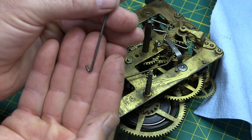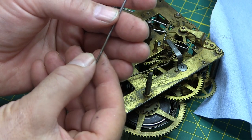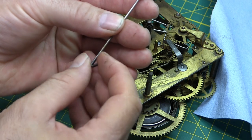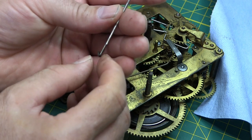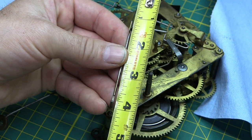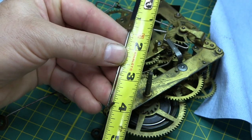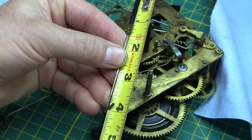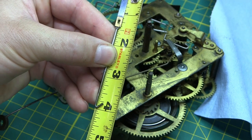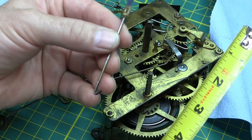It's kind of a unique design — it's flat here instead of just rounded like the American ones. So when Hattori said he made improvements of the Western design, that might be one of them. By the way, if you have one of these little Seikosha wall clocks, from the end of the suspension spring it looks like four inches. If you're missing one in a clock, that's handy to know.